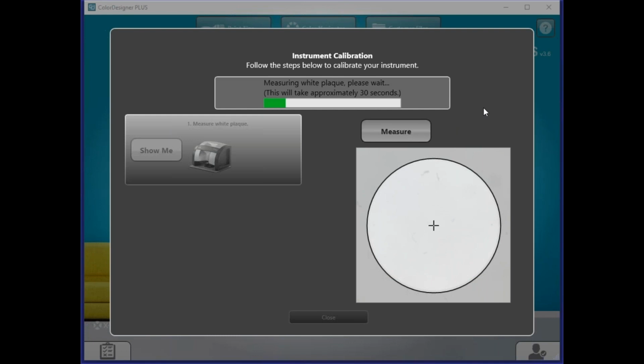If you have the MetaVue, on that calibration plaque there is a little hole, and it's an indicator for the lenses and everything to see that the calibration plaque is in place. For some reason, if you covered up that little hole on the bottom left, it wouldn't calibrate. But that's why it's important. Again, we'll talk about cleaning right after this.